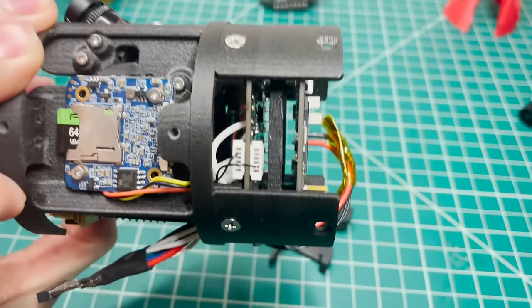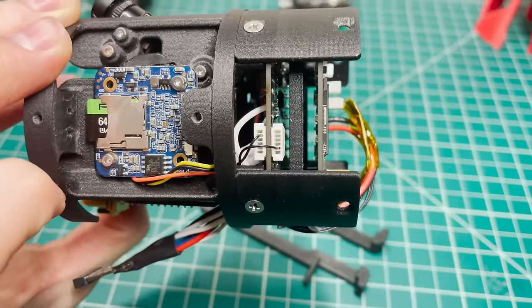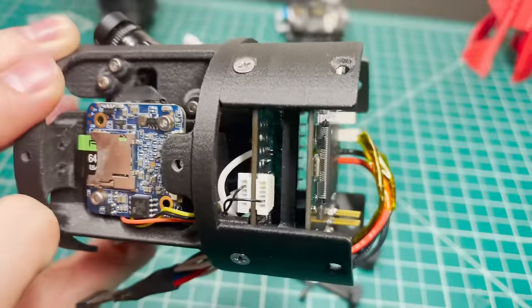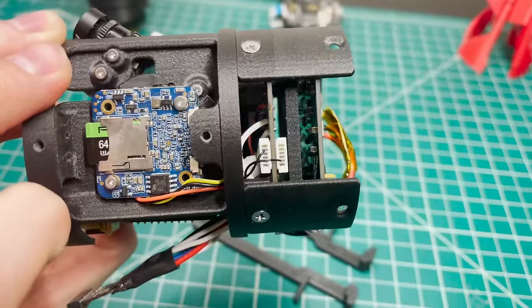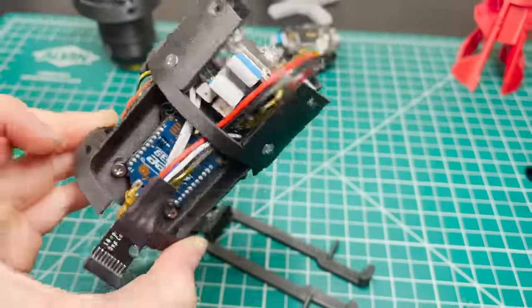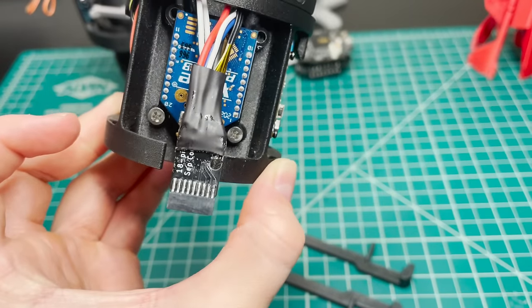We've got two more lines that are connected to these five pin connectors. These are the booster detect and booster IO lines. And then a couple more servo connections, which are just soldered in place because I don't have a useful connector to actually pull those PWM signals off of. So it's kind of a mess. I've bodged a lot of stuff together, but we have that all connected to our 18-pin connector here.